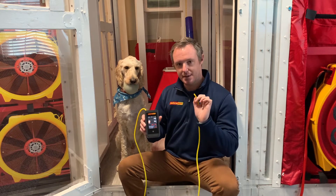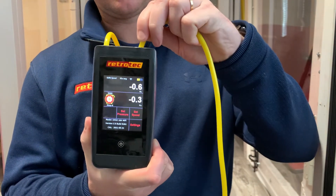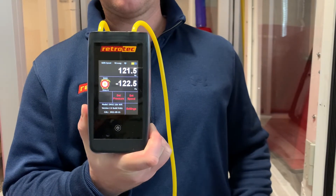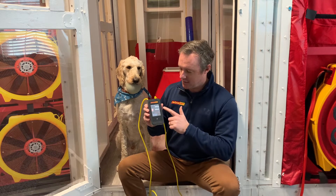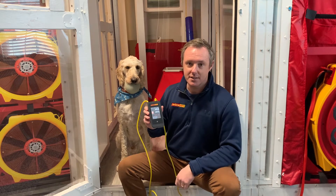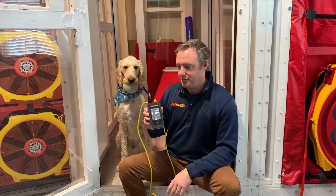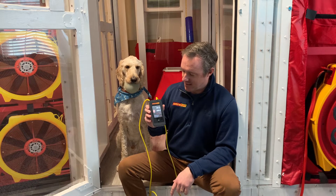If I take the other end of my tubing and go from blue to yellow, there's a pressure built up inside the tube and it's reading that pressure on both channels. In order to determine if it's reading correctly, these two numbers should be within one percent of each other. It doesn't really matter what the number is — with different lengths of tubing the numbers will vary — we just want to make sure it reads within one percent. I'm getting 267 and 268 on both channels here.